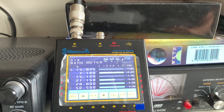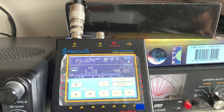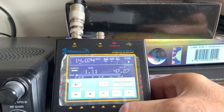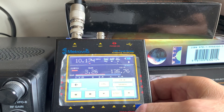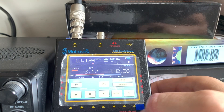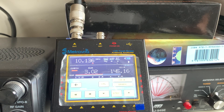I'm going to go back to the menu and change the frequency to 10.136 — that's the FT8 frequency on 30m. So I'm adjusting: 1, then 3, then across again. So 10.136MHz. Here we are on 30m, 10.136MHz.